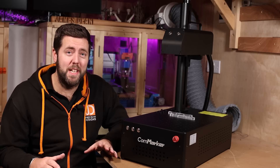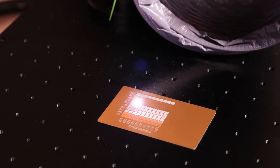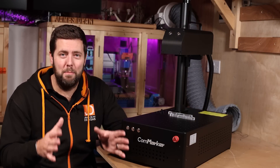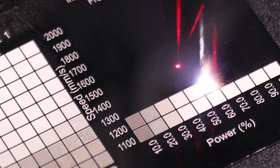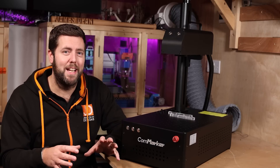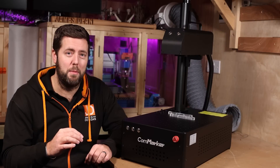Next was to test all new material and test on low power to begin with. It's much better to do that and build up than just go straight in with heavy power, because you won't understand the scale and the differences these lasers are able to produce. And finally, a simple way to understand frequency — if you're familiar with diodes and CO2s, you understand power versus speed, but on fibre lasers there is also frequency as another variable. The easiest way to think about this is like sandpaper: the lower the number, the coarser and rougher it's going to be; the higher the frequency, the smoother and less impact it's going to have on the metal. Points two and three really are the key to getting started.